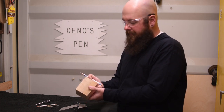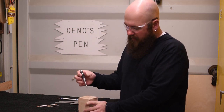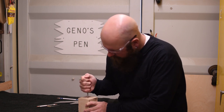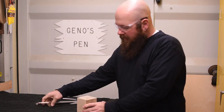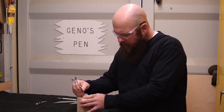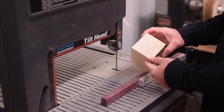Repeat the block process on the other side. Now I'm going to use an automatic center punch to put a small divot in the wood — many companies make these and they're a really convenient tool. Now I have my center punch, I can make a circle on the wood so I know how far to trim the corners off to prepare for the lathe. And this is what you should end up with.